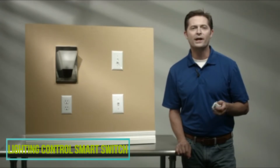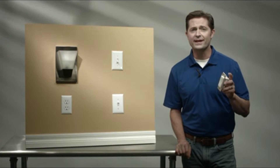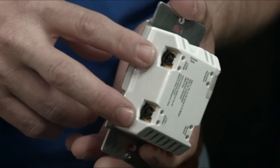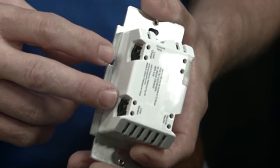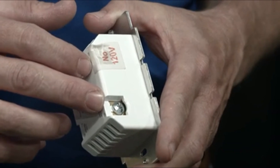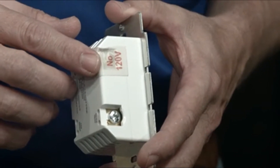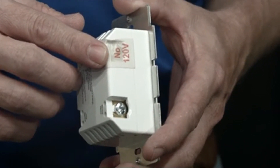Hi, I'm Jake, the DIY guy. Today we're going to walk you through the GE Z-Wave Inwall Smart Switch Quick Start Guide, covering installation and setup. The two black terminals are your load and line terminals. The line terminal is your hot wire that connects your switch to the power. The load wire connects your switch to the lighting. The silver terminal is for your neutral — that's where your neutral lines will be hooked in, normally a bundle of white wires in the back of your switch box. The green terminal is for your ground wire, which is commonly bare copper wire. The gold terminal covered with insulation tape is the traveler terminal, where you would attach the traveler wire for use with a GE add-on switch for three or four-way control of your lighting.